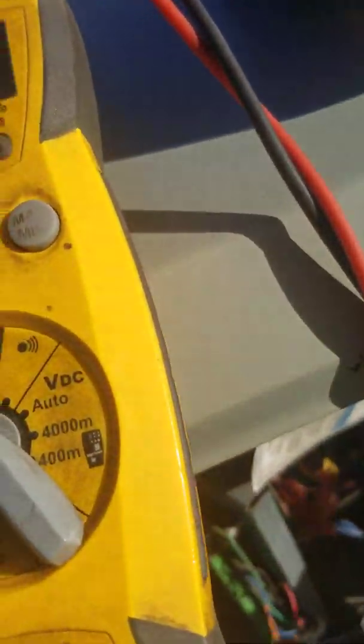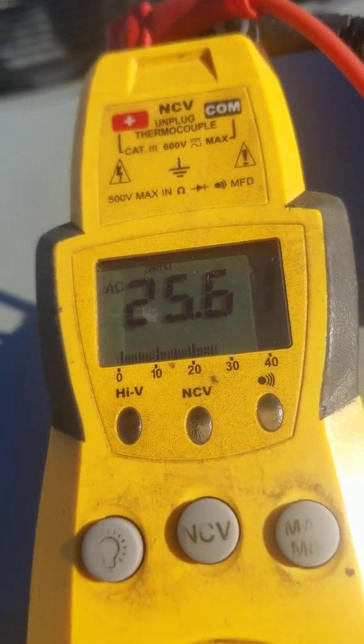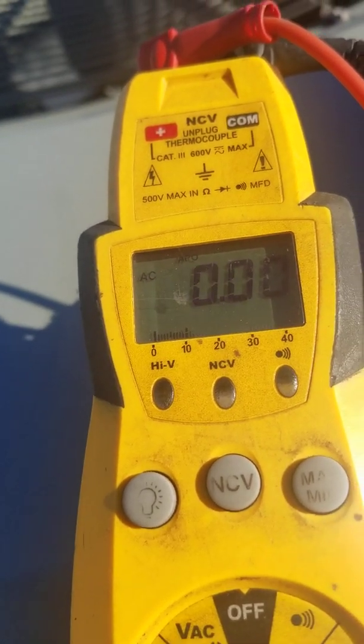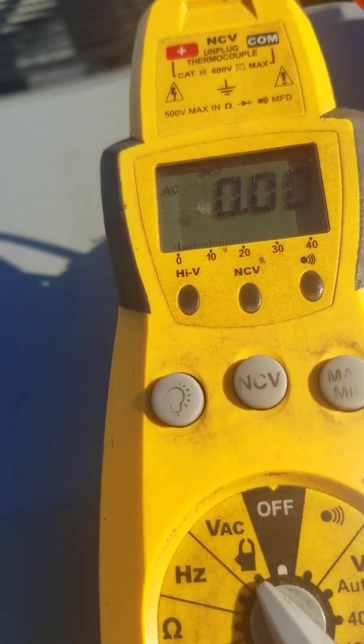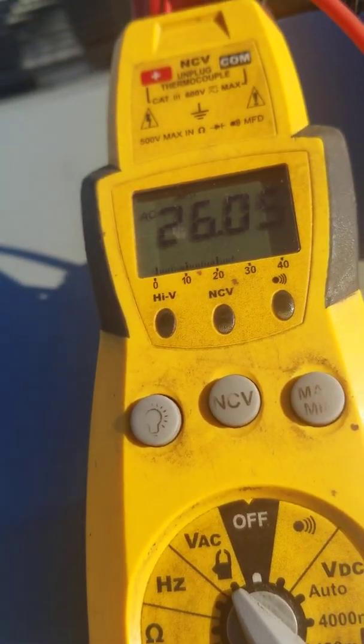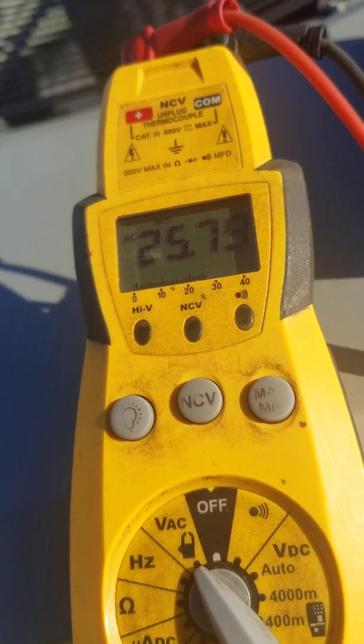While we move the tap over from 230 to 208, we'll see how much voltage we have now — we've got 26 volts, a little over 25. Note: not looking at my fingers over here — might get electrocuted.